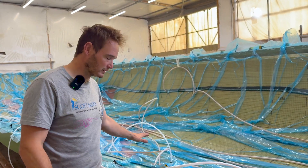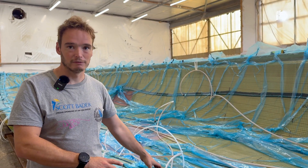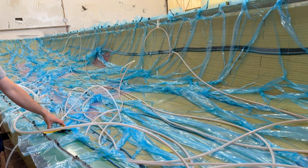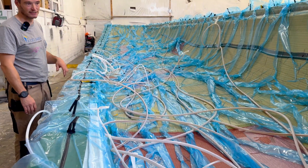How we got to this stage: we released the hull and did a release agent over the whole new mould to get a really nice shiny surface. We've got an excellent mould finish and a really good release agent — the Chemtrend three-part system. So it was a cleaner, a primer, and a sealer.